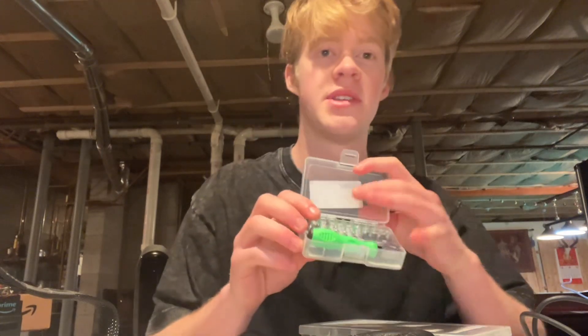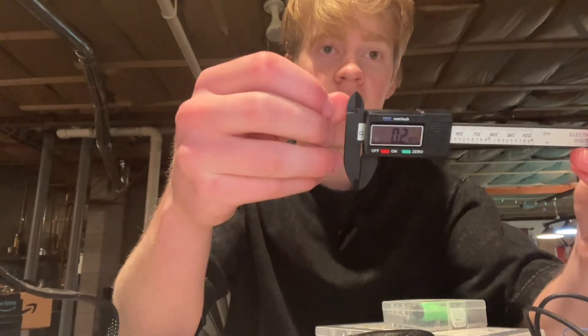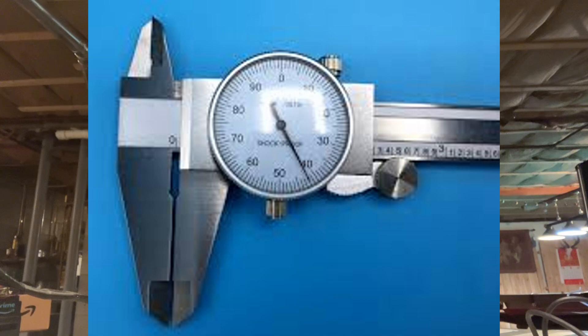Another important tool I found was one of these little mini screwdriver kits. I use these a lot for these nuts and bolts but also just for screws in general and modifying electronics. Two more tools that are extremely necessary for processing and designing prints are calipers. Calipers have a screen that will tell you the distance between two objects. For example, my finger is 15mm in diameter. This would be useful if you have something like a case — you measure it and now you have the dimension. I recommend getting the digital ones.